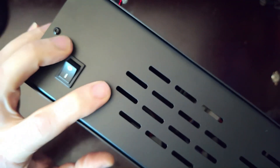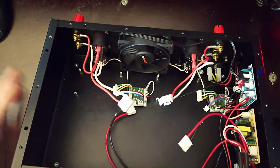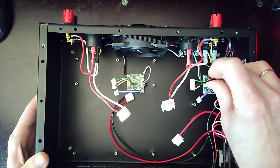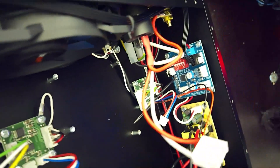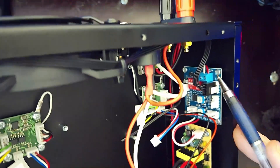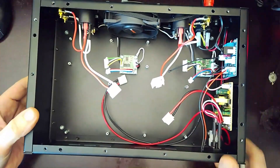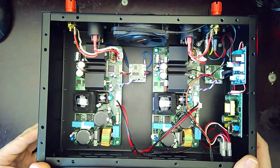On the front panel there is an on switch and a power indicator. Inside you can see the high-quality silent fan. All assembly involves securing the boards and plugging connectors in the correct way. There is a thermal sensor that you place close to the heat sink to sense temperature. Looking more closely: here is the fan management board and an additional 12-volt board just for the fan, so the entire cooling solution is separated from the amplifier board. The small preamplifiers are also integrated in the chassis, along with self-clicking standoffs for the boards — very easy to integrate.